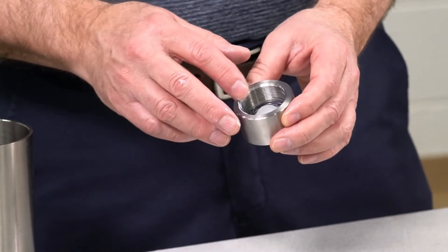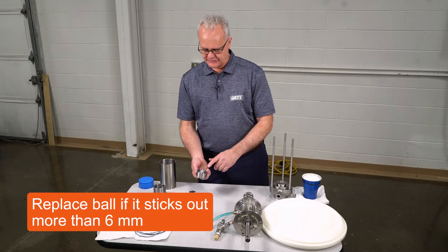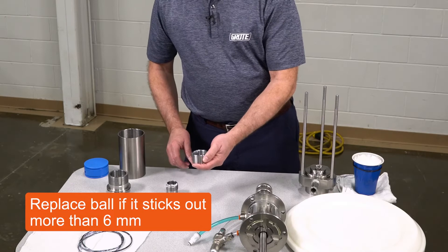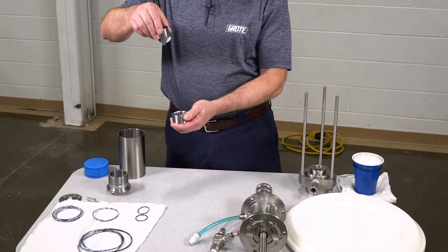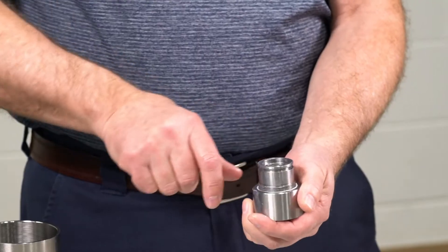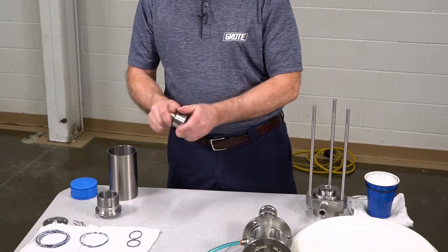Then I'm going to place the ball inside. One of the things you want to look at when you place the ball inside is you want to turn it over. If the ball is protruding a quarter of an inch farther than the surface, it needs to be replaced — it's too small. At that point I'm going to take the spring and set it up in this fashion. The reason I'm setting it this way is it lets the spring hang down so that when I place it on, it's sitting at the center of the ball. Then I'm going to screw this together. Once I get about that far I'm going to look down inside to make sure that the spring and the ball are in the correct alignment, and then I'm going to finish tightening it.